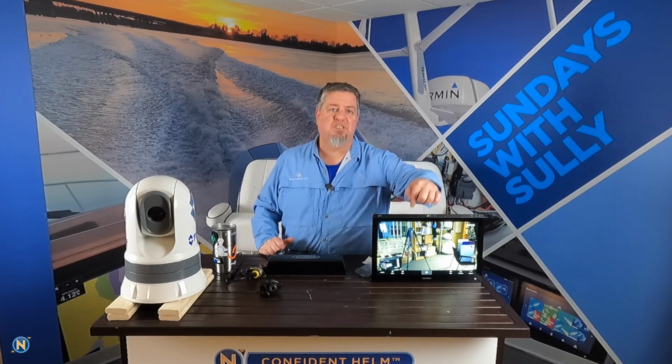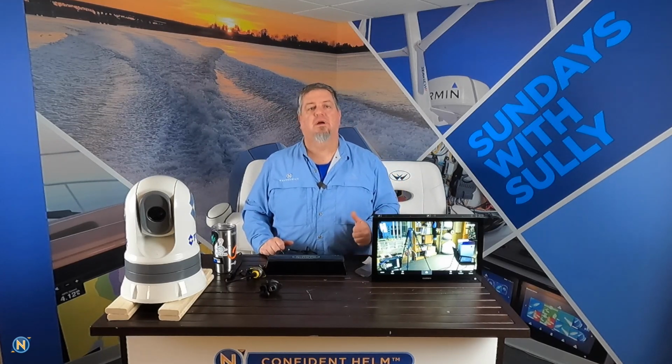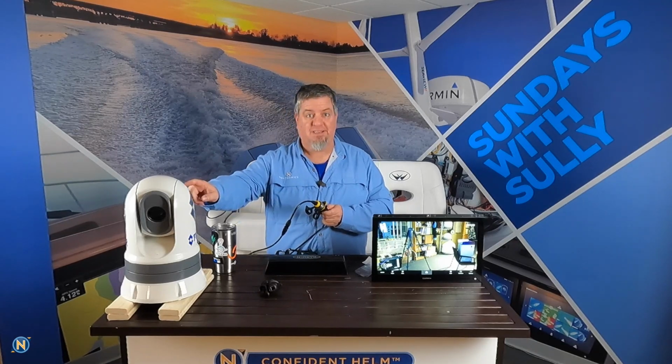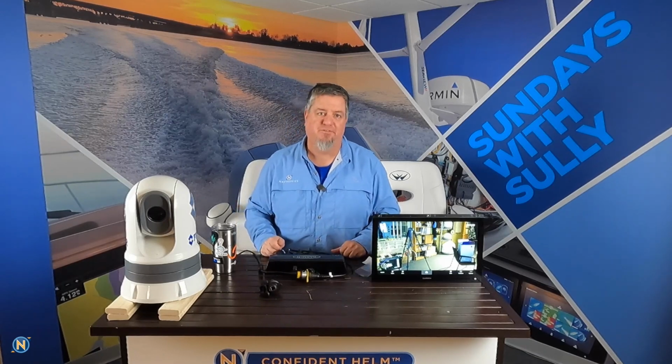One last tip: if you ever get onto a boat and you see loader recovery ready, you get the little red writing down there, that's a Garmin network problem. More than likely, somebody has plugged something like this, a non-Garmin product, into the network without a PoE blocker. So that's a quick troubleshooting tip for you guys out there in the field if you're looking to try and figure out on a fresh-to-you boat what's going on.